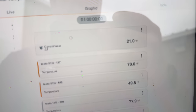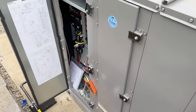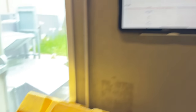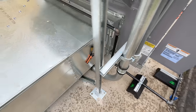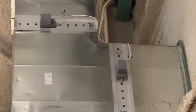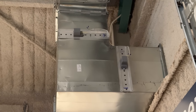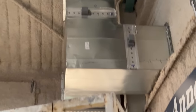Right now we're at about 21-ish degrees. We have a little bit of noise from that belt — I checked alignment and it actually was fine. Static pressure here is 0.18 and 0.2, 0.4 total external static. P2 is my external — that's all we got there. This comes in, goes to a boot, and this is on a zone. Like I said, these zone dampers are messed up because they gave us the wrong ones. So what we did is we pinned that one, and that one does work. With one open, they're able to open and close. Normally open and normally close — just switching on the relays would be enough. Unfortunately when they're both closed because they start in closed position, the static pressure is so high the motors aren't strong enough to overcome the spring force plus the air pushing against it.